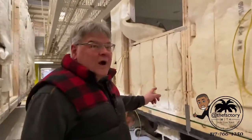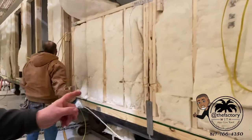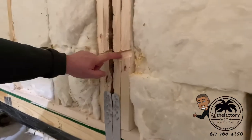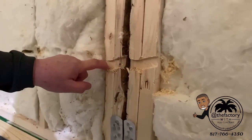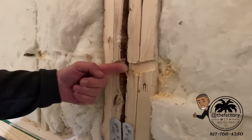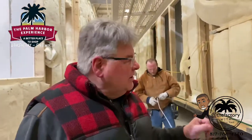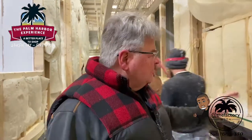Here's the gentleman putting in the wire as he brings the wire runs. Notice this little cutout — this is a dado that's been cut out in the studs. Further along, when he runs that wire through there, he's going to put a steel plate over that. That steel plate will provide protection so if you're driving any nails in — putting on a deck or something on the back of your home — you won't be able to get into that wire.